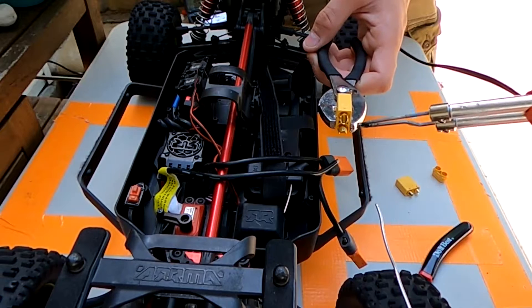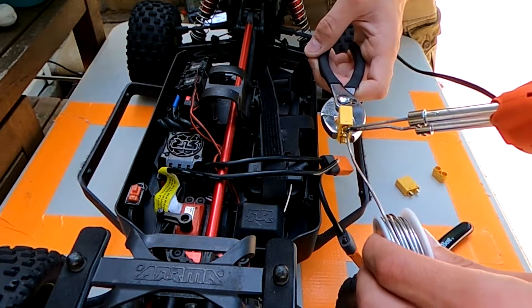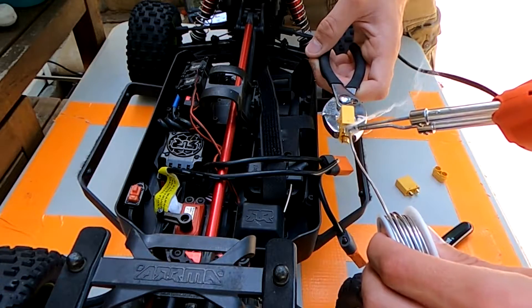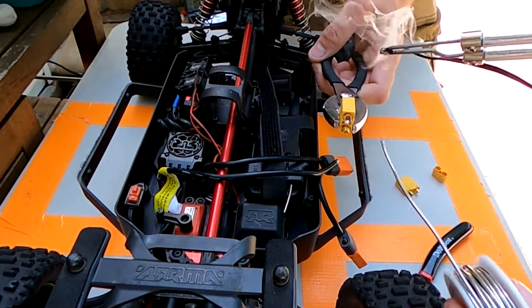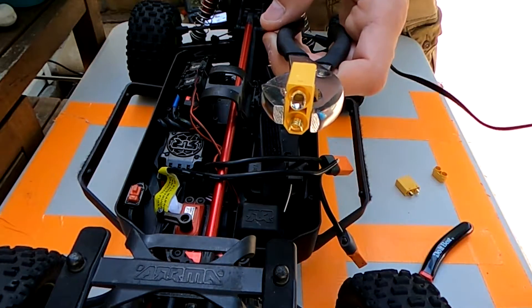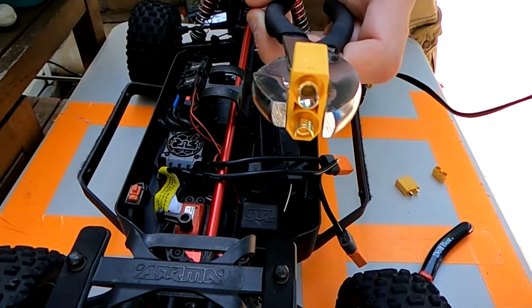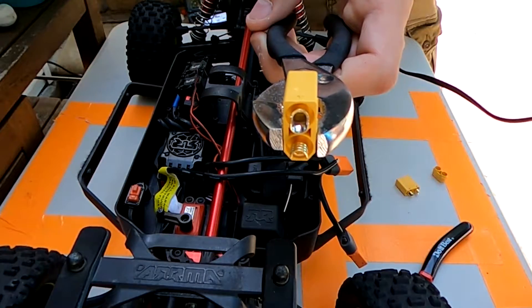What I'm going to do is heat up the cup with the soldering gun and then add tin to it. It's about half full — a little bit less than half full — but that's fine because we're going to make sure we tin the wire very well.